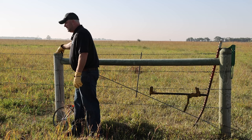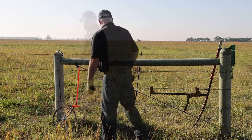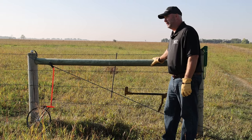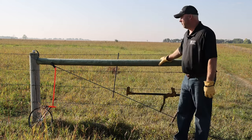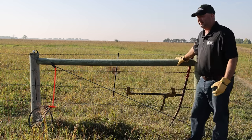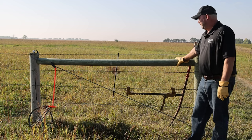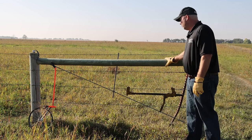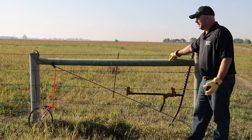For inline posts, some producers will put wood posts every third post. Those wood posts need to be a minimum of three inches in diameter and a minimum of six feet — that is the height requirement for an inline fence post. H-braces are required at all corners and at all angle turns greater than 15 degrees. Definitely recommend that before you install this practice, you have your job sheet, your specifications sheet, and the job design plan so you know how to install the fence and what materials are required, as everything I just listed represents the bare minimums to construct a general-purpose fence.